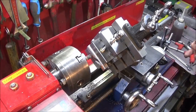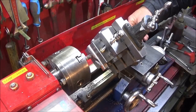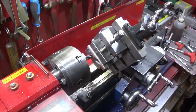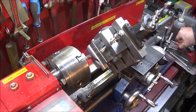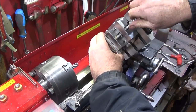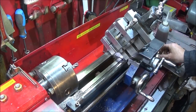I've got a DTI clock set onto the carriage at the back so I can move it in by 10 thou each time. I have to put a key under the pallet to undo the carriage lock and then move it forward by 10 thou — something I'm looking into extending so it's easier to reach. I also hope to get a graduated handle for the lead screw so I can advance the carriage very finely. And there we have a nice cross cut with a very good finish — I'm very pleased with the rigidity of that milling slide.